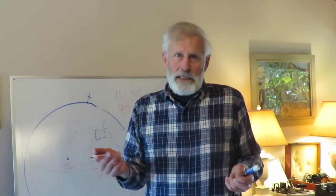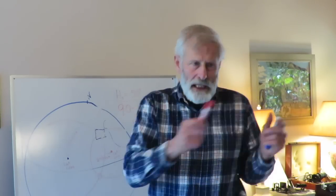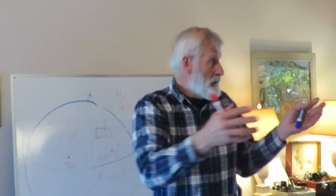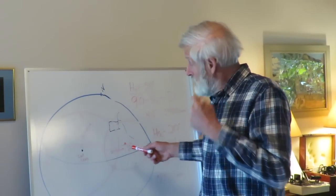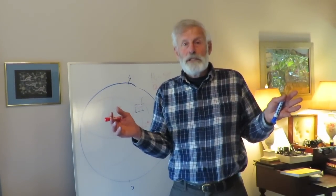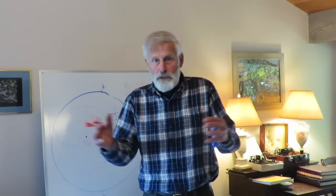So realistically, you have ideally a 15-minute window. You can probably extend that to a half-hour window to take stars right when they emerge in the east, moving around, taking your stars in the west. That could be stars moving around to the south and the north as you move around to the west. But the sun sights you can take any time during the day. So star sights, you can take 5 sights and they can all be within 15, 20 minutes of each other, or even closer, maybe within 5 minutes if you're fast with your sextant. And you don't have to worry about how much you move during those sights.